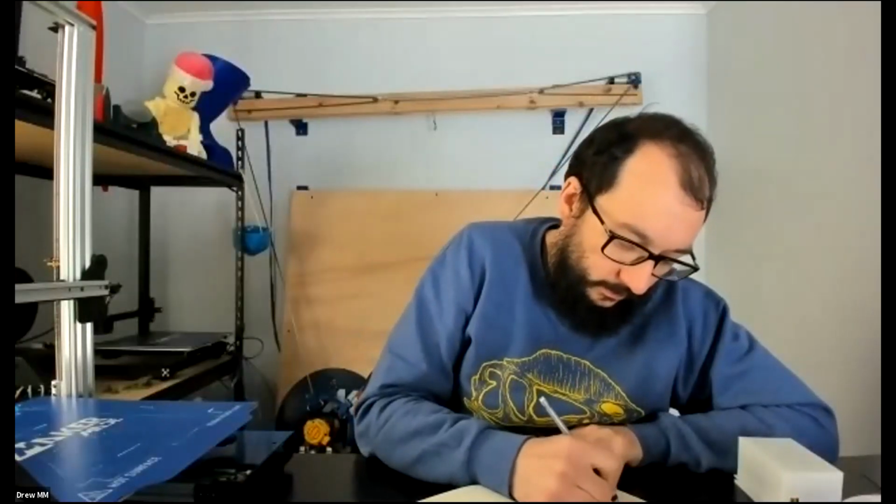Drew, something that would be nice for you guys to put in the marketplace, or something that you could sell, is a shim pack that has multiple shims at 1 millimeter, 2 millimeter, and 3 millimeter thicknesses. That's a great idea. With that smaller clamp you have, it would be able to cover from 65 millimeters all the way up to 72 millimeters. Just a simple shim pack for people to buy different routers, and they can slide those shims over their router when they put them in there.